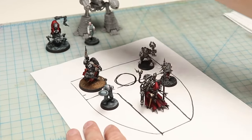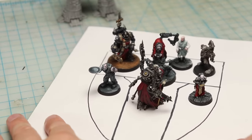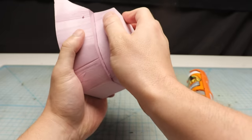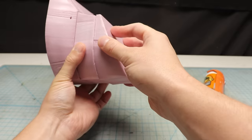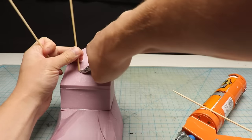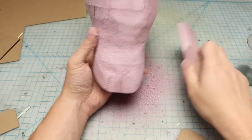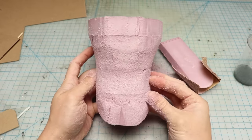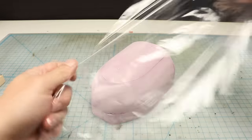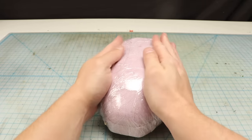I wanted to have a space for characters to come and go — something less like a cockpit and more like the bridge of a starship like the USS Enterprise. This floor layout became the footprint for a series of jigs I made from chipboard, allowing me to cut the rough shape of the head in several layers with more precision than if I'd just been eyeballing it. With those pieces, I assembled the lower head shape and glued them together with Gorilla Glue construction adhesive, sticking in some cocktail skewers for rigidity. I used sandpaper wrapped around a curved bit of foam to shape the jaw with smooth complex curves. I also made a rounded cranium piece for the top of the head, gradually using finer and finer sandpaper to achieve a smooth finish. Then I wrapped the cranium piece in plastic cling wrap, securing everything to a piece of wood with masking tape for weight and stability.